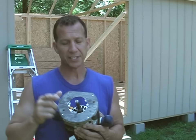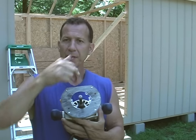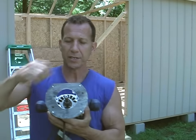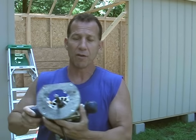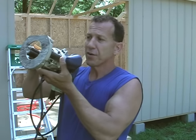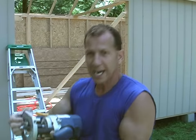Here's a point I want to make sure you understand if you're not familiar with routers. When you're using a router, the spin direction is this way. If it is this way, you push against it. Don't go with the direction of the spin because then it'll want to walk off on you. When you go into cutting this edge here, you start off on an edge. Make sure you go right against the studs on the inside and use that as a guide.